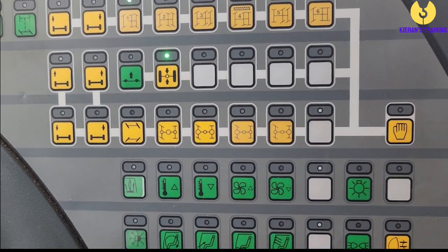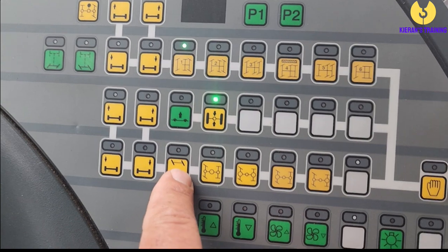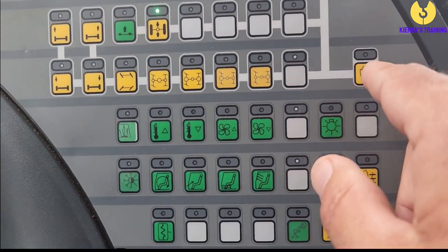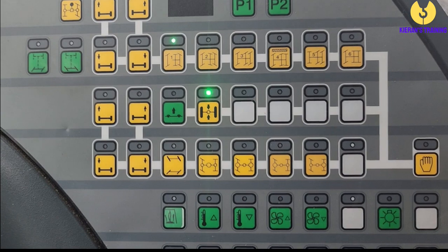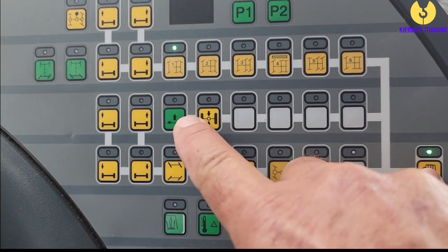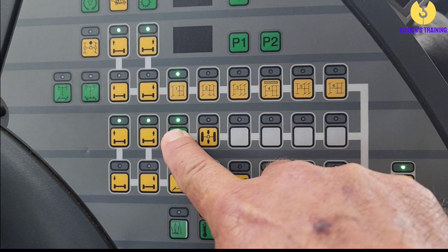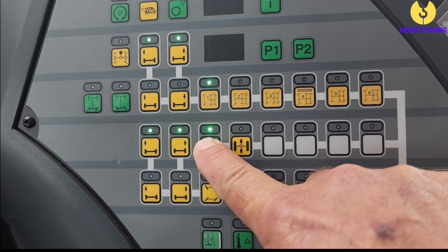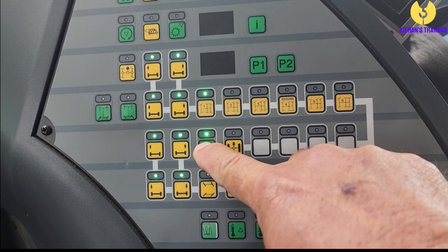Down at the bottom — this button is for manually adjusting your rear axles. You activate that one and use these two buttons to move them left or right manually. Keep in mind you do need the hand button active first. So at the moment the crane's lowered and the suspension is locked. If I was to put it into road travel, the first thing you need to do is unlock it — press the little hand, hit that button and the light will go out, then hit the green travel button and wait until everything starts flashing. Once they're all flashing, you're all set for traveling on the road.